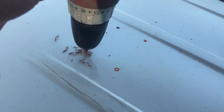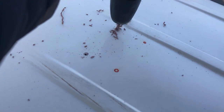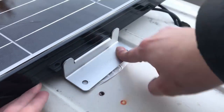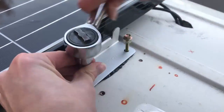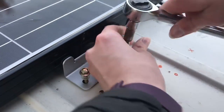Once the liquid nails were dry, I got back up on the roof and drilled over the top of where I had pre-drilled those metal holes, so now I was pre-drilling down into the modwood as well. I then used some butyl tape as a preliminary way of sticking the brackets down onto the roof, which also acts as a sealant, and then I screwed down into those pre-drilled holes.